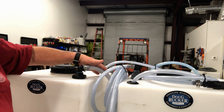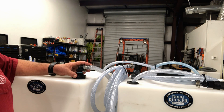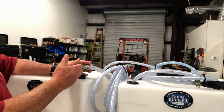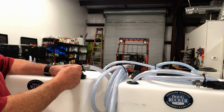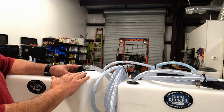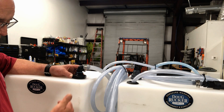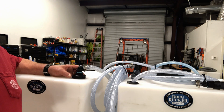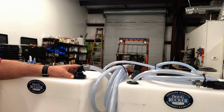This is actually the water fill coming in from the garden hose, so we use bulkheads for that. What happens is guys will use these bulkhead fittings and take a drop tube — like a PVC stick, usually that gray PVC with threads — and thread it right into the bulkhead on the underside so the pipe goes all the way down to the bottom of the tank and draws the solution up.